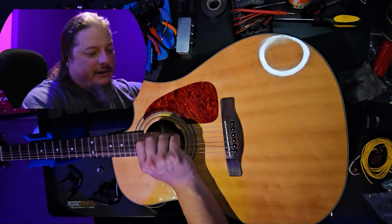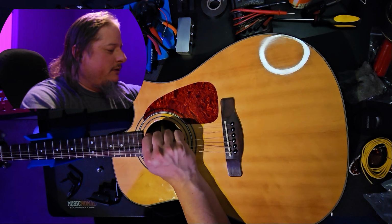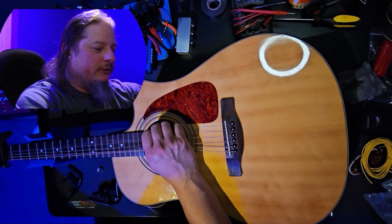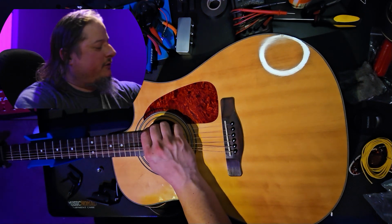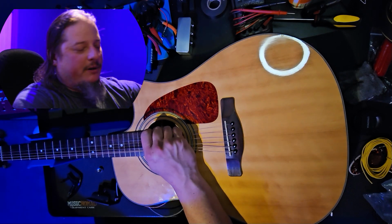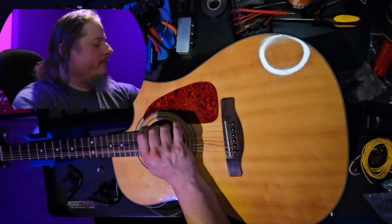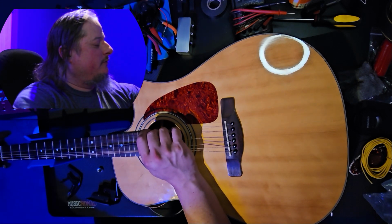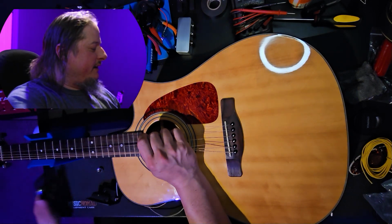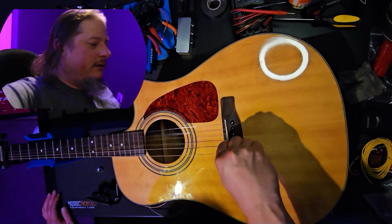And what I'm going to do is lose tension on the strings, and then put a capo on the first fret. So, kind of an old school trick. If you have an old Fender guitar, like an old Fender Strat that has its truss rod adjustment to where you have to remove the neck from the body, that's one of the old tricks they used to use. You want to hold tension on the strings while you're backing them off, so that the knot at the end doesn't undo itself. But then you just boop, capo there, and we're good to go.